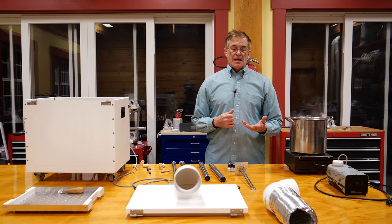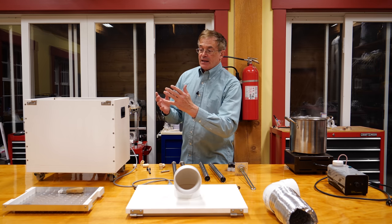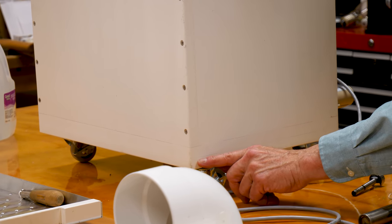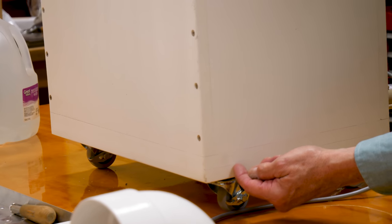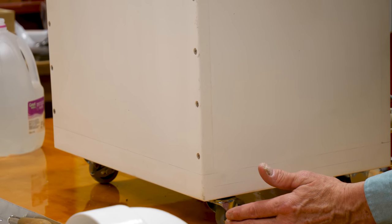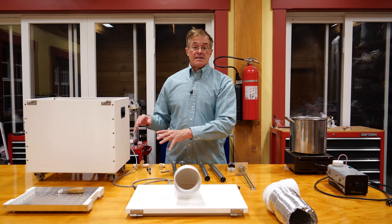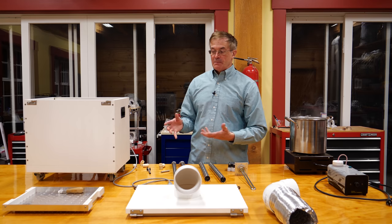The fact that it tends to be light makes the box more mobile and easier to use. I fabricated this by building a square box structure with butt joints. There are actually two layers of material on the bottom — not really needed for structural purposes, but I wanted a thicker piece so that the wheels on the bottom, when I drive screws into them, don't have to penetrate the box and have more material to bite into. With 20 kilograms of ice and 10 kilograms of water, the whole structure is talking about 40-plus kilograms — 90-plus pounds. You need wheels.